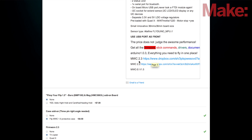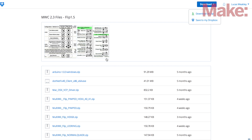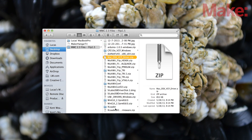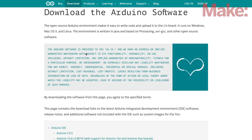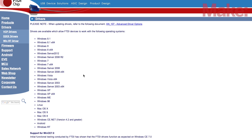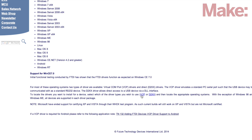While you're waiting for the board to arrive, you can download all the software. There's the Multi-Wii controller 2.3 software — click the link and it'll bring you to a Dropbox folder where you can download the zip file. Go through and download all the drivers applicable to your system. You'll also need the Arduino software from Arduino.cc — go to downloads and get the version for your computer. And if you don't already have them, get the FTDI VCP drivers, as they're very useful.